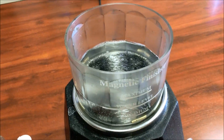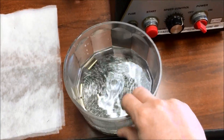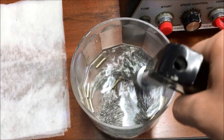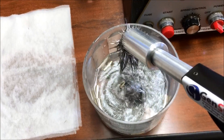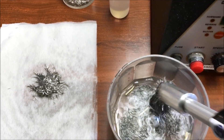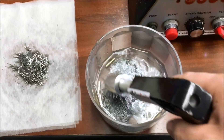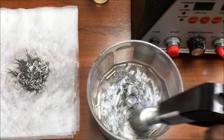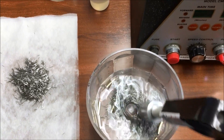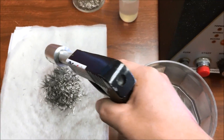When the finishing cycle has completed, you can remove the media bowl from the motorized magnetic base. Once the finishing media demagnetizes, you can remove it using the magnetic separator tool. Since the components being finished are non-ferrous, they're not attracted by the magnet and remain behind in the media bowl, allowing you to collect all the media for removal.